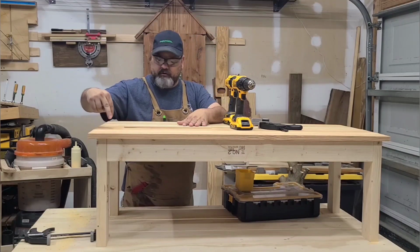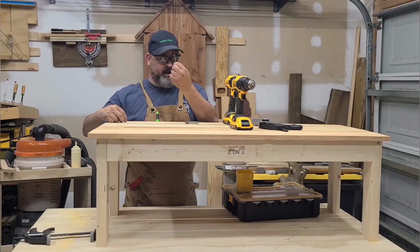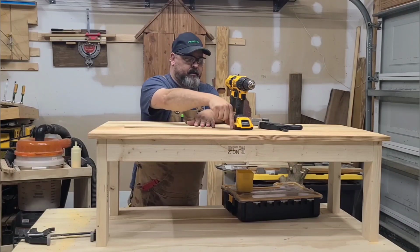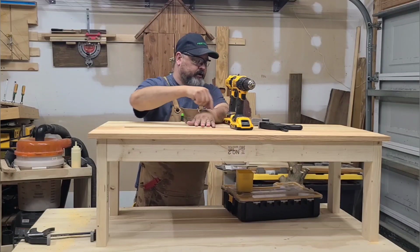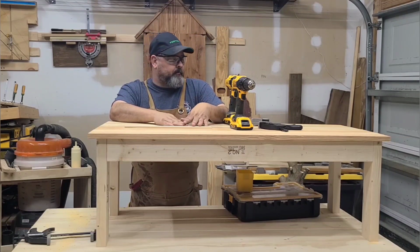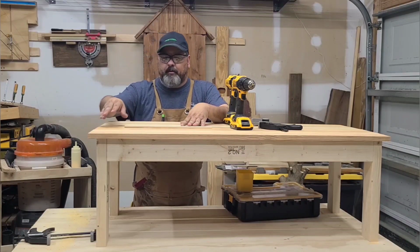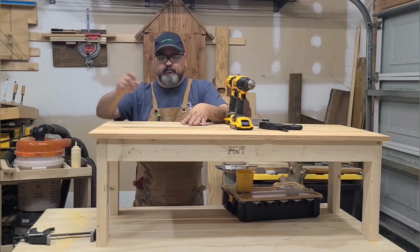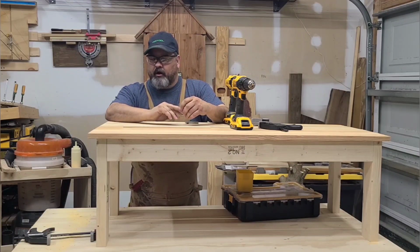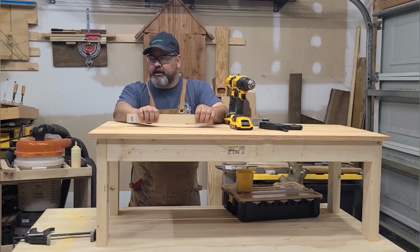Basically two 1 3/4 inch deck screws in each board down the side, and then I'm going to apply 3 more on the front and the back, and then 2 down each center here, and that'll pretty much seal it in place for the top. And then the next step will be to sand it down smooth, round over the sharp edges, and then chamfer the legs, which will hopefully keep it from splitting. And then I'll paint it a gray color to match the rest of my furniture that I have outside. But other than that, that is pretty much it.